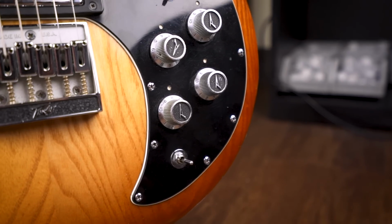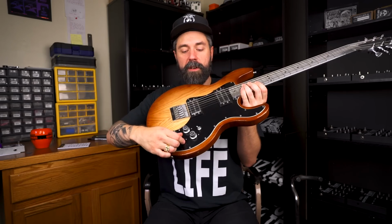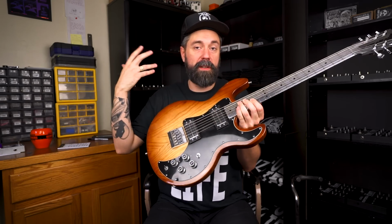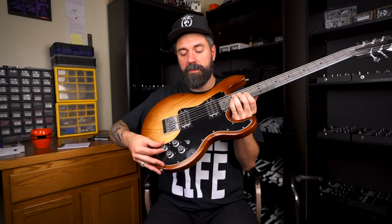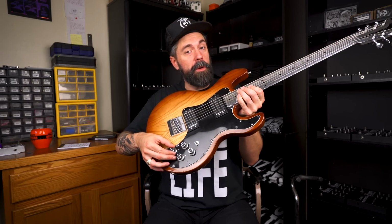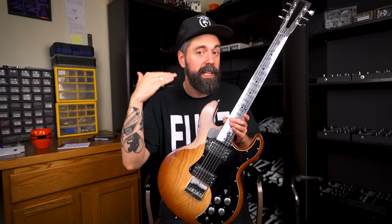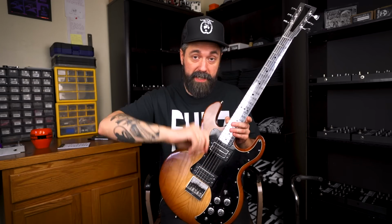That's also something kind of weird that I may modify on this guitar. We have a volume control for each pickup, and then we have tone controls. But here's where our coil tapping comes into play. When we have our tone controls all the way up to 10, it makes it so that the pickups are like single coil pickups. It coil taps the humbuckers. When we roll the tone knob from 10 down to 7, it provides a slight treble cut like a normal tone control. From 7 to 4, as we keep turning it down, what happens with a very innovative way they wire the electronics is it blends in the second coil and blends it into being a humbucker. From 4 to 0, it's like a normal tone control, and it takes the humbucker and takes a lot of the treble out of it.